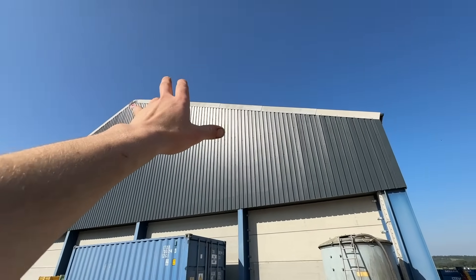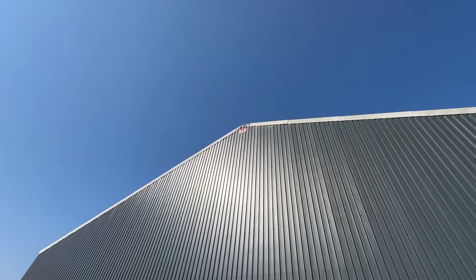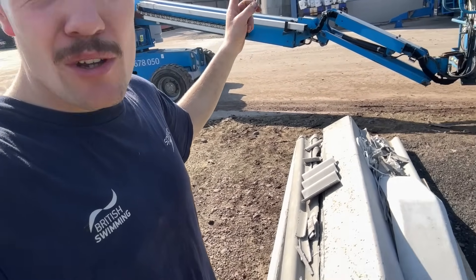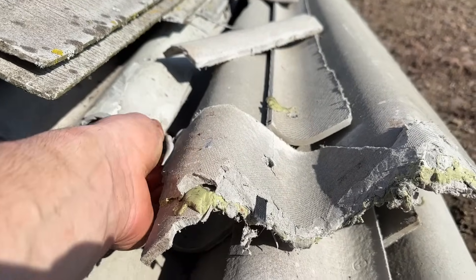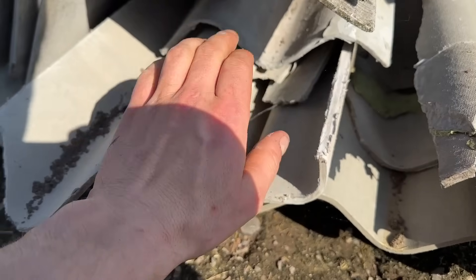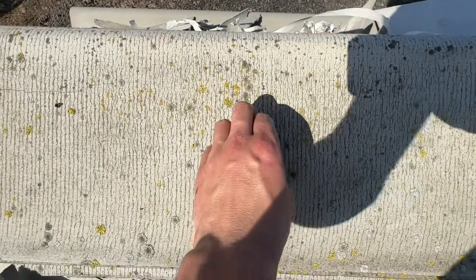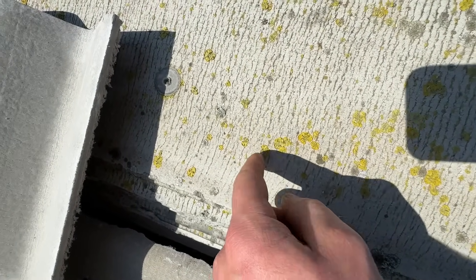The boys who were at the roof almost got finished, but the end piece wasn't delivered, so they've not got the apex bit done, which is a bit frustrating. They were up here for two days. The last guys who tried to repair it pulled the barge boards up and shoved a load of mastic underneath, which meant everything was so stuck together — just a pain. That's two sheets bridged together with loads of mastic — just ended up a nightmare getting it all stripped. On grain stores you're meant to use tape and not mastic, probably for this exact reason.